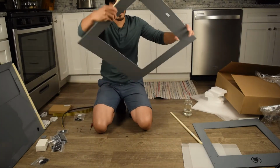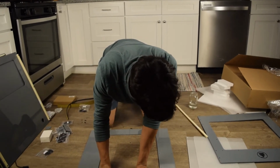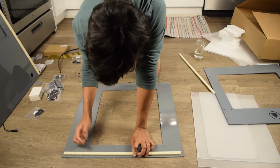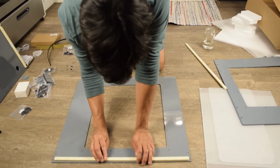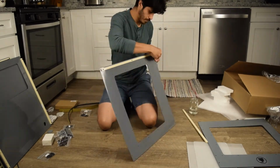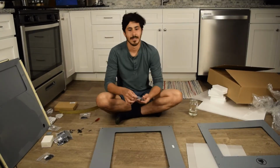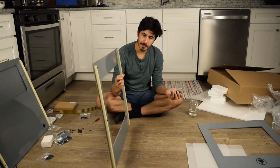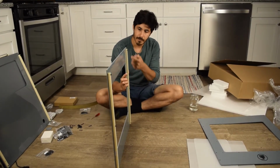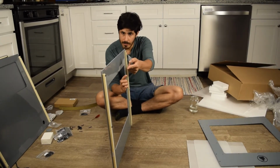Make sure that you have an 1/8 inch gap. In this case, your 2 holes here and your 2 holes here should be facing the inside. Okay, so now we got the framing pieces on the right side. Remember, flat one in the front where the foam weather strip goes. Vertical one in the back where it connects to the next piece.